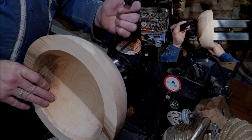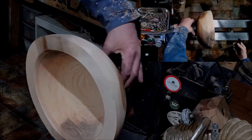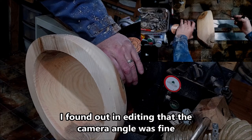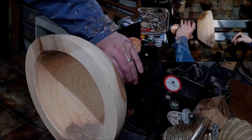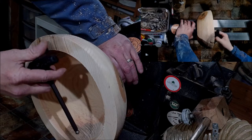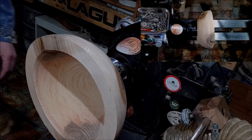This could be quite a pretty bowl. When I was cutting it I actually could have got a bigger blank out of this, but with something like olive ash — you have dark and the rest of it is light — if you can get the two of those exactly opposite each other it looks like a better balanced bowl. When I was cutting this blank, it was slightly off, so I sacrificed the extra size to get that dark piece as close to the middle of the bowl as I could, because it's just aesthetically more pleasing.